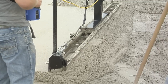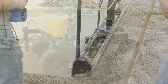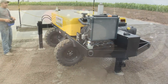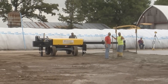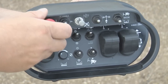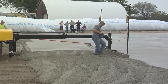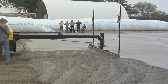Perhaps one of the most exciting features of the Screed Saver Max is the continuous diagnostics display, constantly monitoring and displaying hydraulic and electrical functions of the machine, giving you comfort that all systems are operating properly. Screed Saver Max is the only remote-controlled screed in the world. Our construction-grade wireless system controls every machine function. Furthermore, most of the functions of the remote system are fully automatic, including downrigger memory placement, automatic vibration on and off, and a completely automatic laser leveling system that, when activated, doesn't even require you to watch the laser leveling process.